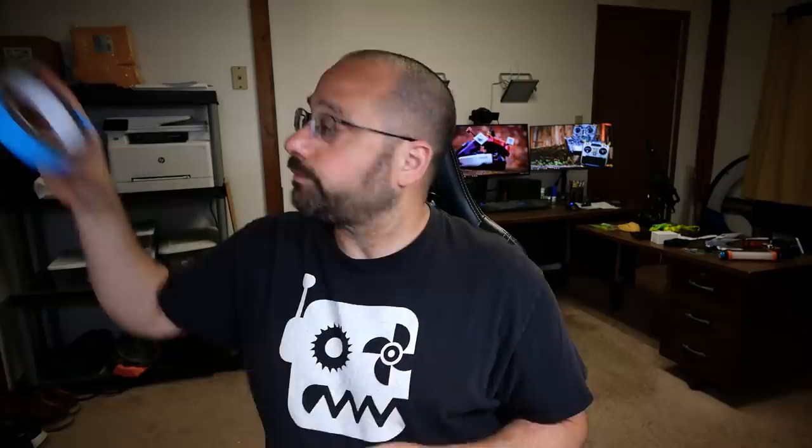I'm thinking we should put some tape or something. This tape is sold as servo tape, but I think it's going to be actually really perfect for this application because it's kind of thick and springy. The problem I have with direct soldering things like this is it's oftentimes hard to remove if you don't have a hot air rework station. Getting all of these pins to flow at once so you could desolder them would be tricky. And if you don't have a hot air gun, you'll damage things trying to get it undone. So wires, at least, you can always desolder. But this seems reasonably rework-friendly.